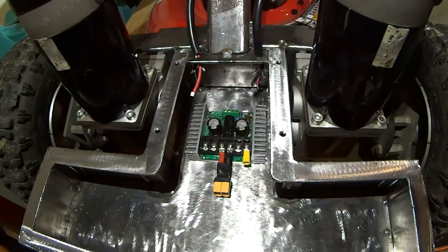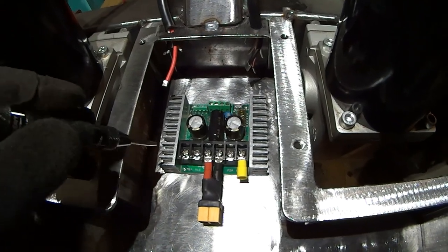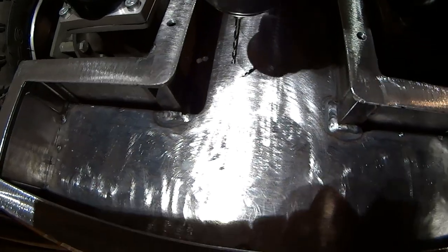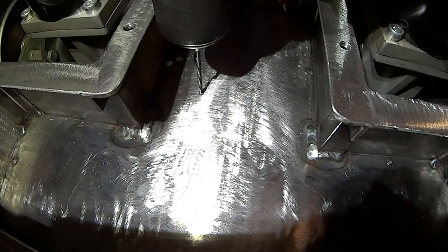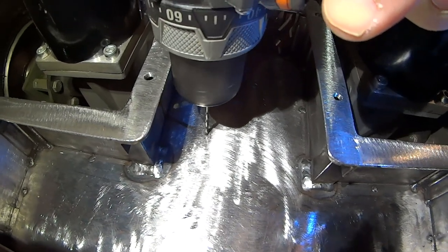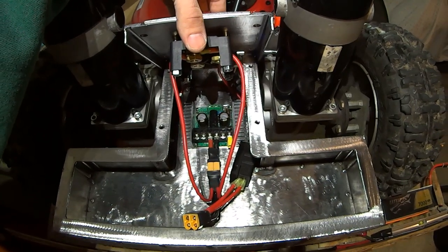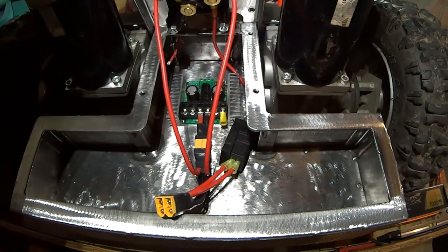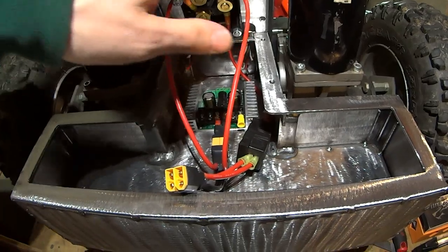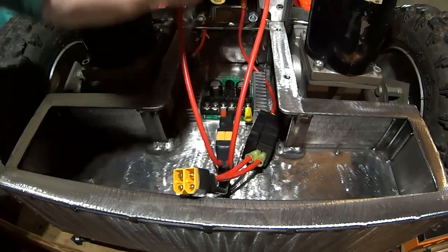Here's your common lead, this guy in the center, and then there's your battery one and two - these plug into the batteries themselves. I've got the driver in there where I want it, far enough from the back wall that I can plug the micro USB in and out. Now I'm going to use this spring-loaded punch to pop these holes and then drill them with the 1/8 inch drill. Battery one, battery two, and the common wire up top - get your fuse and then you've got your power in.